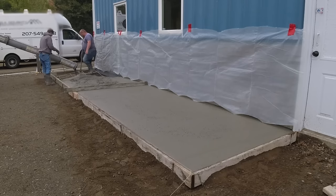The concrete's set up enough now where you can press in on it with your fingers and it's firm — but your fingers might only go down about a quarter to three-eighths of an inch even when you press really hard. The surface is still a little soft but the concrete's set up pretty good. This is probably about an hour or so after the pour. We're mag-floating the surface out, getting it a little bit smoother than the bull float, getting any bull-float lines out — just getting it ready to stamp.